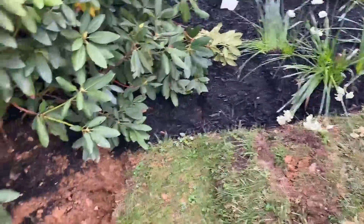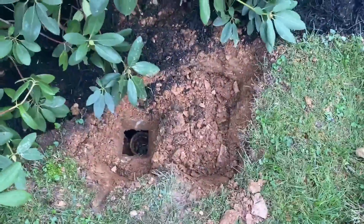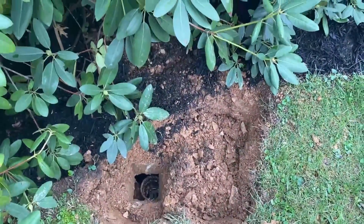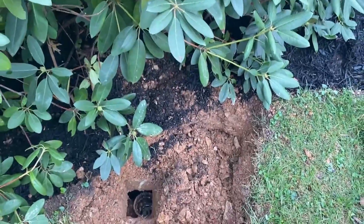This property is only accessible by the lids on the tank, so we're going to recommend installing a riser. Risers are super important on septic systems so you can get to the tank efficiently and pump it more easily. If a lazy pumper digs up one of the tiny side lids instead of the main middle lid, you won't get an effective clean, which will cause problems for your absorption system. The baffle is in place — its job is to prevent floating debris like toilet paper, fats, hair, oils, and greases from getting into the pipes.